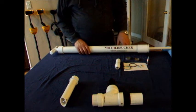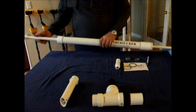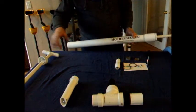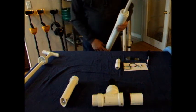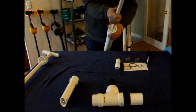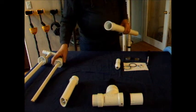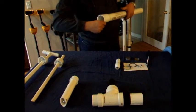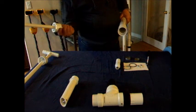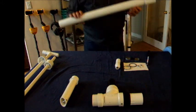To convert to prospector mode, first remove the sniper head and set it aside. Remember, if you've used it and it's wet, the seal will be soft — handle it carefully. Wiggle the inner rod out gently and wipe down the housing with a rag to make sure there's no sand or grit that could cause wear, both inside and on the outside of the housing.